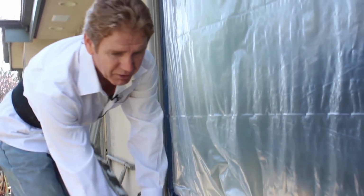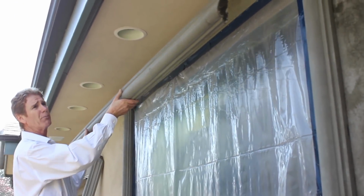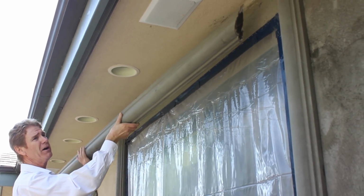And by the way, guys, never cover your weep screeds. I've seen a fella do that, and he called me, and he had a problem with his windows. I said, somebody buried your weep screeds. Now, generally, this is a two-man job, because I'd hold one side, Jason would hold the other, because I'm going to put it on there.